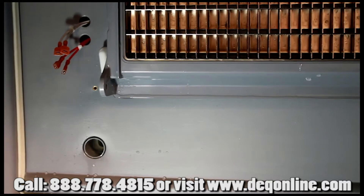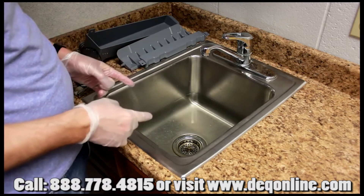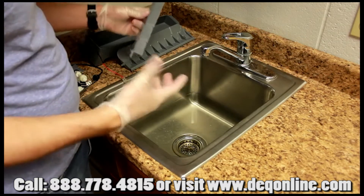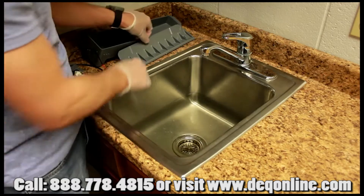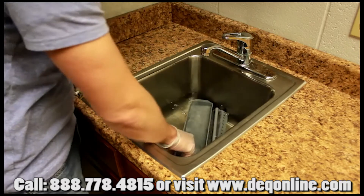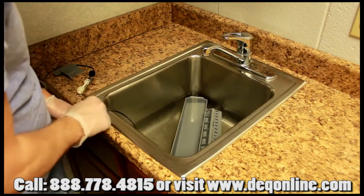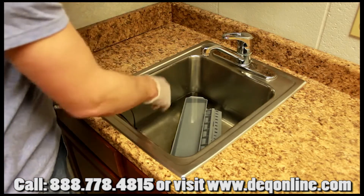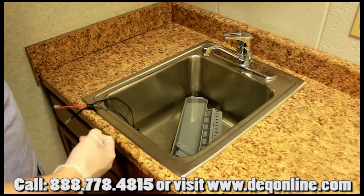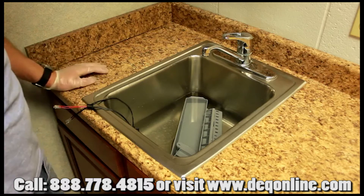Now we can take these parts over to a wash bin for cleaning. I've already mixed cleaner with water — it's a one-gallon of water to 16 ounces of cleaner ratio. All I do is take the components, drop them down inside the water, and just let them soak. You can also take the floats and put them in the water — just don't let the leads get wet. I'm going to let those sit there and soak for a little while. As they soak, they will begin to foam, and that foaming means the cleaner is working and getting rid of lime scale and mineral deposit buildup found on the components.